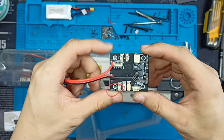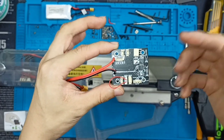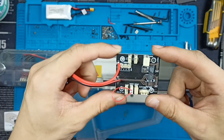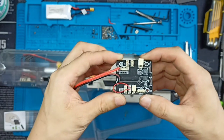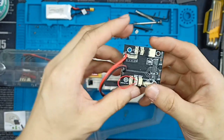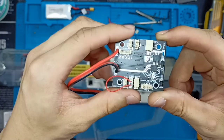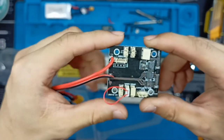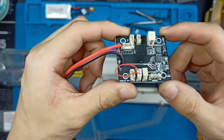We can't actually mess with the chipboard ourselves because it is digitally locked and is only accessible by QWK themselves. So they had no choice but to make an extra 30 units of the chipboard with the bug fixed. There has been some delay waiting for this chip to be programmed, tested, and then shipped to us. To replace this chipboard is pretty simple — there are several sockets and you just need to solder two points. De-solder from the unit itself, then solder it back to the chipboard.